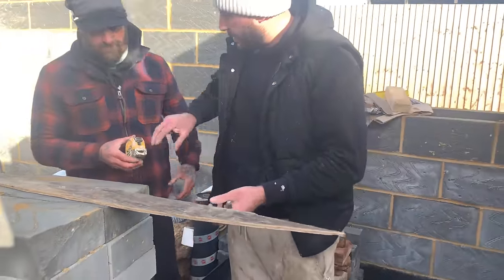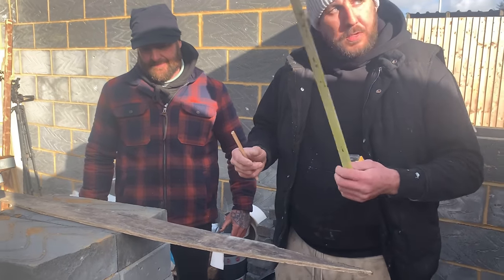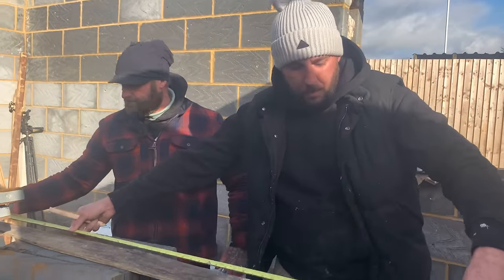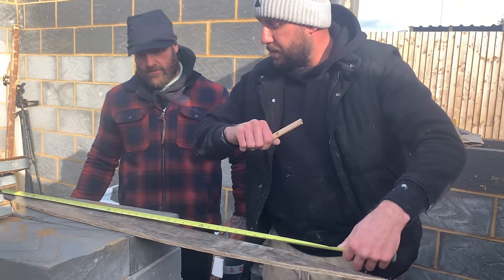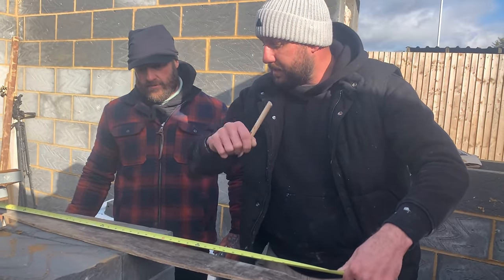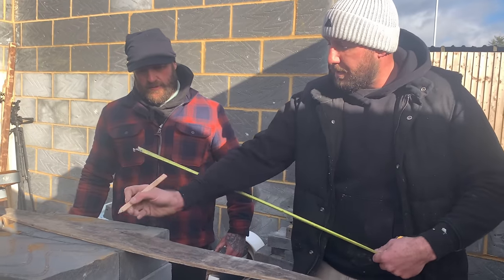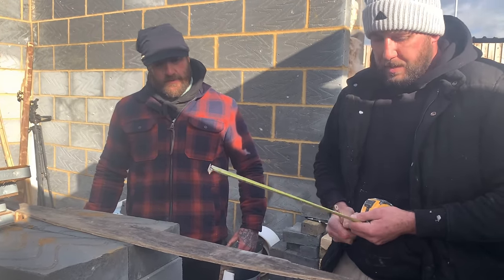Cool. So I just did it using a bit of knowledge and a bit of experience, really. I just took the measurement from inside, 4-4, divided by 2, that's our center line. We knew our tolerances inside the ceiling, so we come up 100 mil, and then we just followed the true line and met the two up, and that obviously tied in with Dean's theory.